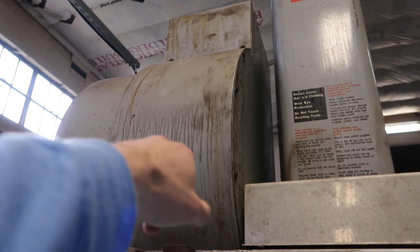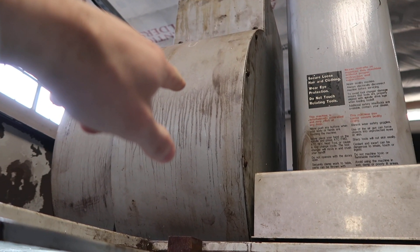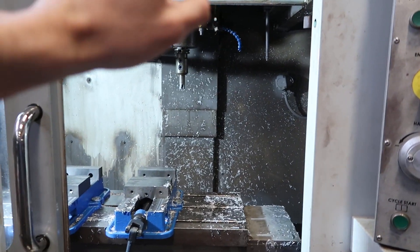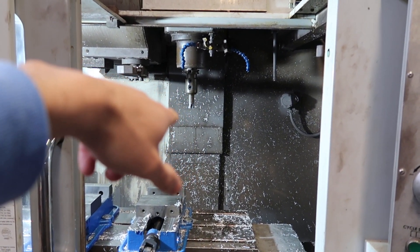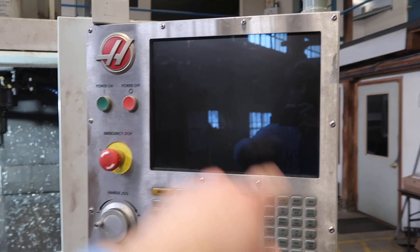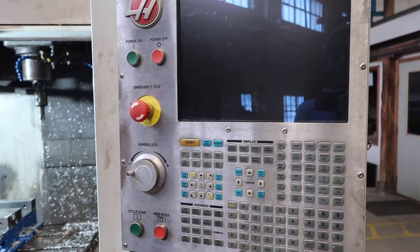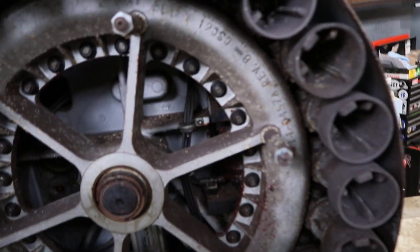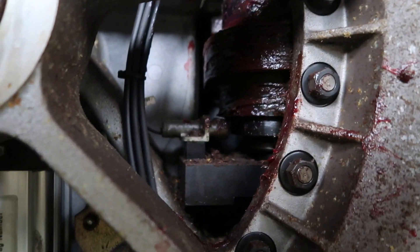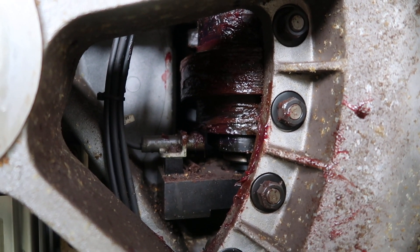The only things I've had to address: I had to replace an air solenoid in the side-mount tool changer — it was sticking open, losing pressure when changing tools. I also had to replace the batteries in the panel to keep the settings and parameters, and I didn't make a backup in time so it lost all settings when I turned it on one day. Haas customer service is amazing — once I changed the batteries they talked me through recovery on the phone and it didn't cost me anything. I'm having one other issue now: this worm gear on the side-mount tool changer — the motor that drives it is skipping teeth. It still works, but if it has to rotate more than a couple tools it hangs up and you have to recover the whole turret.